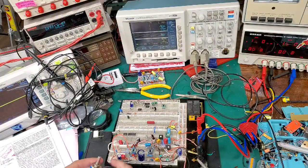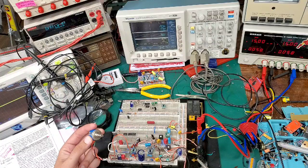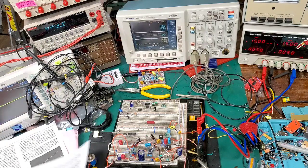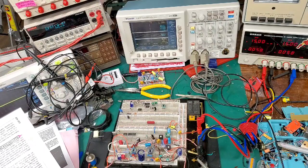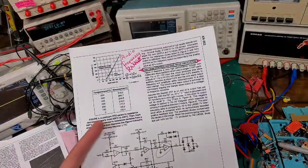Okay. So for my control voltage, just used a little 10K pot. It's supposed to be linear from, what is it, 0 to 20 kilohertz from 0 to 10 volts. Obviously, you can take it a little bit above 10 volts. You can take it above 20 kilohertz. It just depends on how you have it set up. I went with it as bog standard just because I want to test audio filters with it, so I kept it how it is.